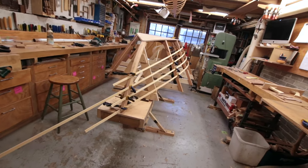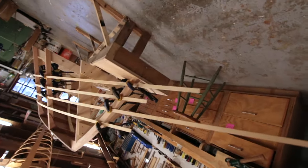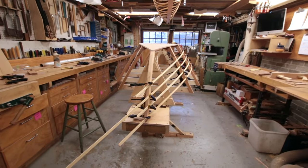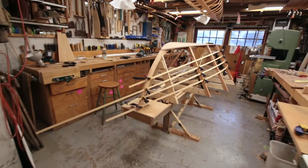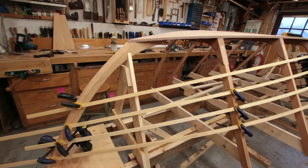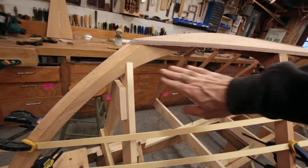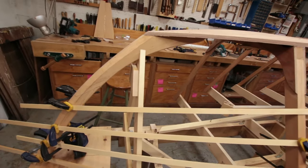One little trick we use when building these things: it's hard to visualize what the boat's going to look like when you're right side up, so it's really common to turn yourself upside down and try and imagine you're standing alongside the boat. You could even lay down on the floor. Our garboard plank is quite wide - some 16-inch wide plywood planks, 3/8-inch thick, and they're lying on here really nice, except I need to do a little bit of shaping near the forefoot area. Planking wants to cup a little bit when you try and twist it, so I knew we were going to encounter that quite a bit there.